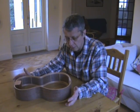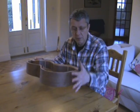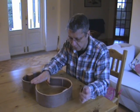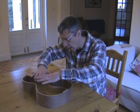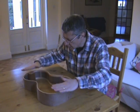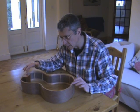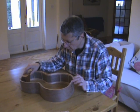Once the linings have been glued in and shaped, the surface of the rim which is going to be glued to the soundboard is sanded so that it's completely flat, and you can see it sits nicely on this flat table. The back surface is sanded to take the back, which is curved. But all of this is curved, and indeed if I turn it over you can see how it pivots where the waist is. The idea is that when I curve the back of the instrument, I want the maximum curve to be at the waist.